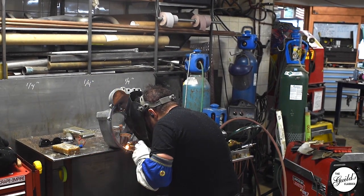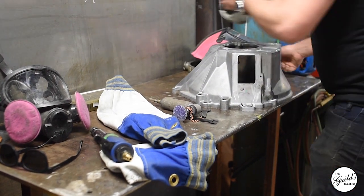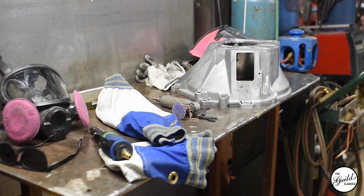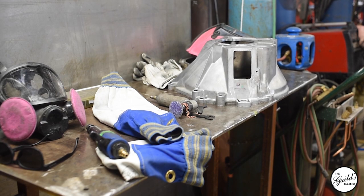The other issue with automotive castings is that if they've been anywhere near engine oil or exhaust gases, it's a porous — almost spongy — material. It will absorb that oil, those exhaust gases, and the hydrocarbons in them. The longer it's been under a car or in use, the more of a pain it's going to be to weld.